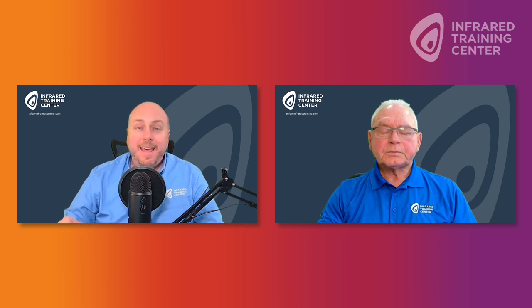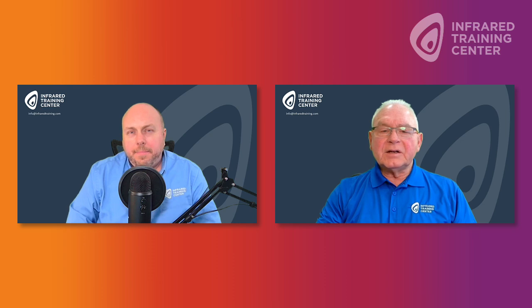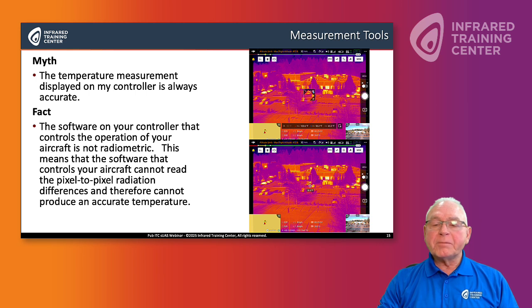So how about this one when it comes to temperature measurements with sUAS? The myth here being that I can apply a measurement tool on my controller during flight, and then that temperature will be correct. Is that a myth? It really is a myth. The fact is that when you place a measurement tool, whether it be a spot or a box, on the controller that operates your aircraft, remember that that software is not radiometric. So the temperature that you get could be very, very wildly off.